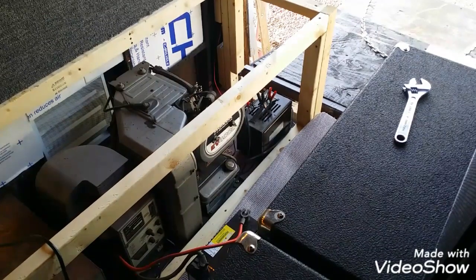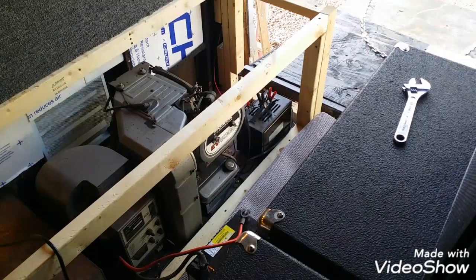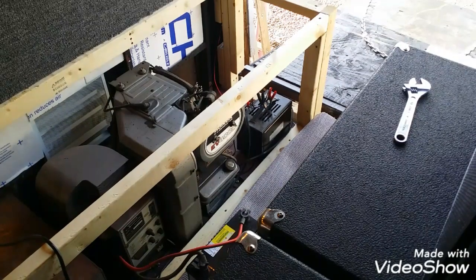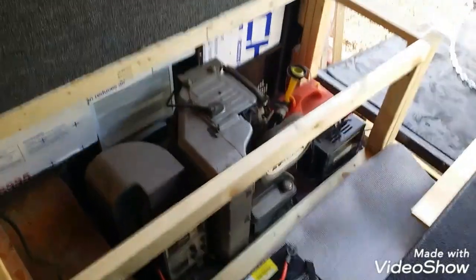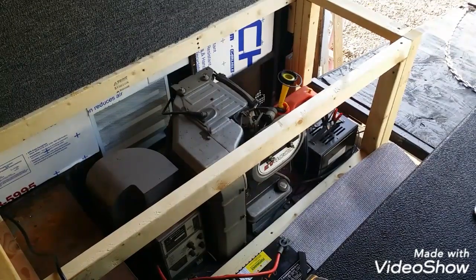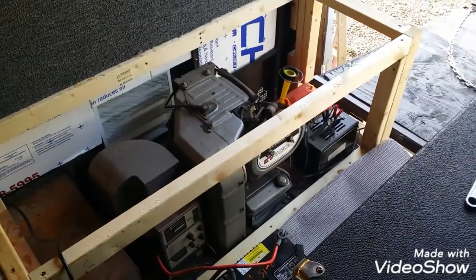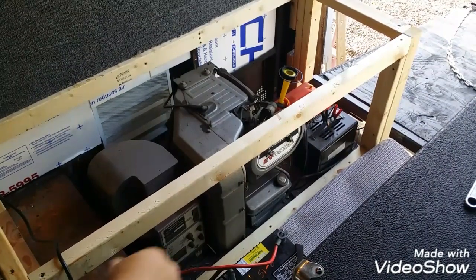Alright, let it rest for a sec. It's an electric fuel pump, but it's running while it's cranking, but it doesn't run when it doesn't crank. Hang on. Okay, I put a little gas in this little gas can back there. And let's get it running on that, get the carb full, switch it back over to the big tank, and maybe it'll catch a prime. Try again.